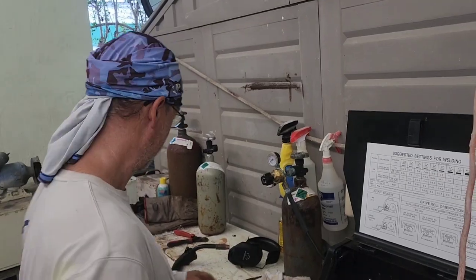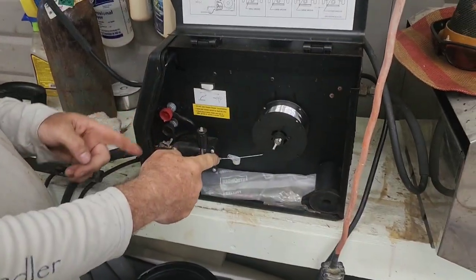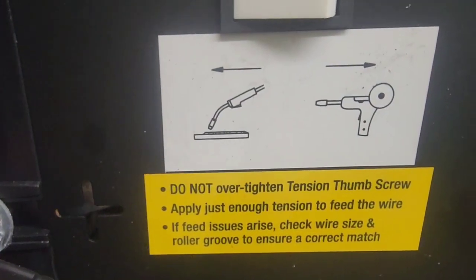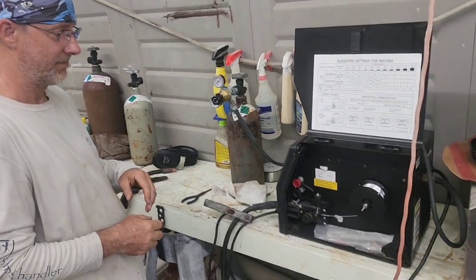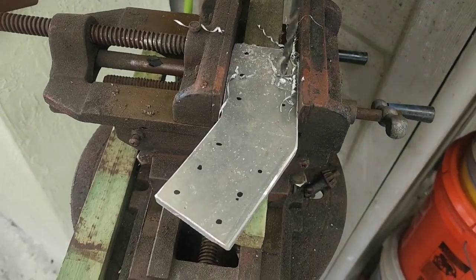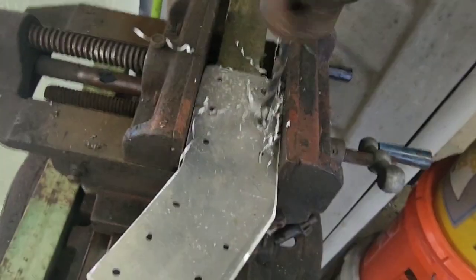This is my friend Sam - we're at his garage doing this welding work. We did get it done but we struggled because we didn't have quite the right setup. Because of Mike's welding ability, he was able to make this aluminum spool work through the long liner even though that's not how it's supposed to work. It's a picture of the gun setup you're supposed to use with aluminum - now we know why - the aluminum wire is too soft to feed properly. But we got it done with many tries and a lot of grinding. Don't try this at home. We're making some gusset plates to go on top of the angles to strengthen them where they're welded - that's the weak point.